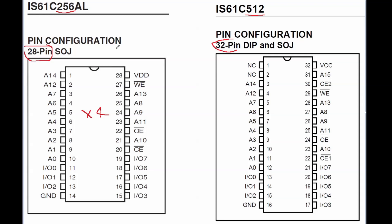Now it's typical for 486 motherboards to have 8 of these sockets, or sometimes provide 4 and 4 of these larger sockets. So in general for 486 motherboards, depending on the chips you install, you can go higher to 256 or 512 kilobytes of cache. Unfortunately this is a 386 machine, so we have to work with these 4 sockets here.